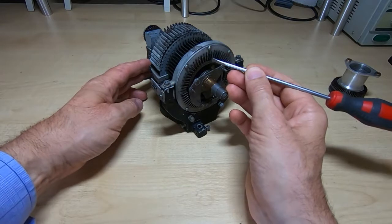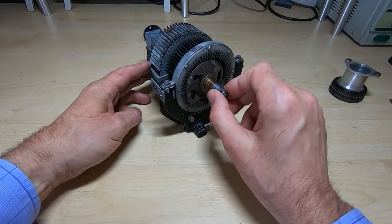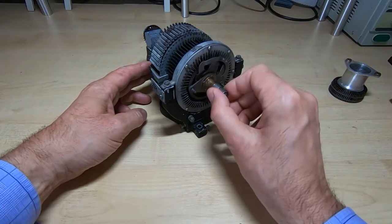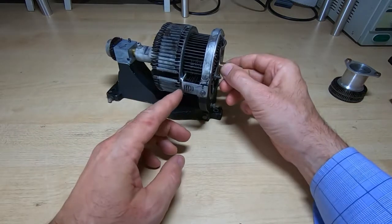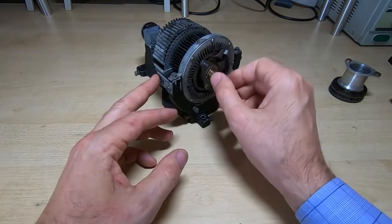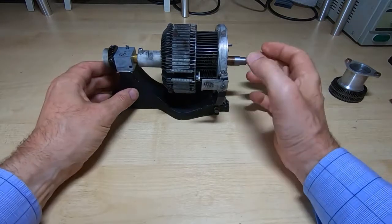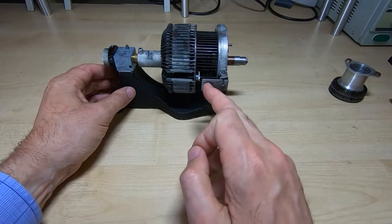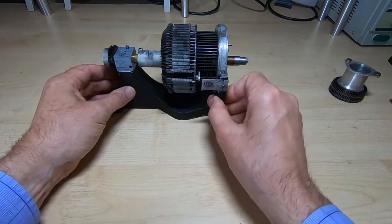You can see this particular lever has fallen down, and so when the shaft rotates, it will come up against that particular pin and it will stop, and that has then selected the character that we want to print based on this combination, which is 00011. If we set a different code on these, then a different lever would fall down and this would stop in a different place and select a different character. So the purpose of the rest of the machine is just to enable us to select different combinations on these pins, and as I go through the various parts of the machine, I'll look at how that is actually achieved.